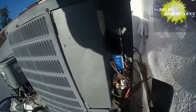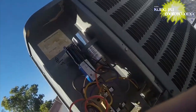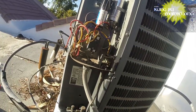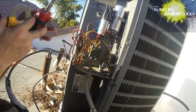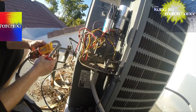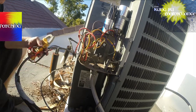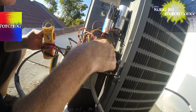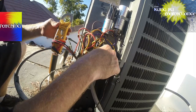One thing I didn't check was the contactor — to see if we got continuity across the contactor. Being as hot as we are, I'm pretty convinced that we do. So again, take it to an ohms test. Going to re-discharge the capacitor since we plugged it in — it kind of acts like a battery and stores the power, and it can bite you. I don't want to be bit, especially on Friday. Testing continuity from the bottom of the contactor to the top, and we are good there.